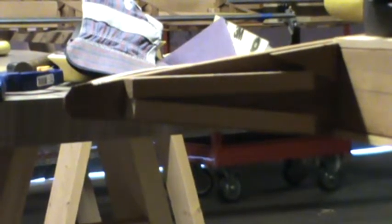And what we're going to do then is level a wing panel with the use of a laser level so that I know that it's nice and level and I know I have a good level reference for building the aileron itself. Now on the Steen Skybolt, the aileron gaps on the outside edges is shown as 1/2 of an inch on the plans, and that's what I'm building it at. If I want to tighten them up later, I can do so by laminating some mahogany plywood on the ends of the ailerons. No big deal, but plans call for 1/2 inch, and that's the way that I'm going to build it.